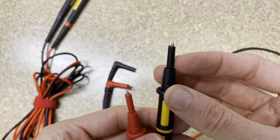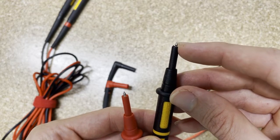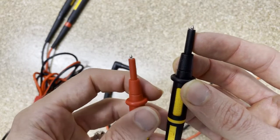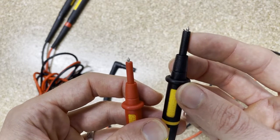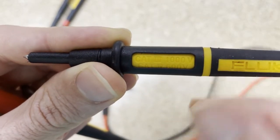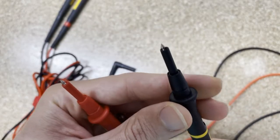You can see they are shrouded. All test leads have to come with only four millimeters of metal exposed if they're going to be used in an industrial environment — whether it's CAT III or CAT IV. You can see we only have four millimeters exposed on both the red and the black. A lot of times they'll come with cones, but most people throw those away. These are rated CAT III 1000 volts, CAT IV 600 volts — the highest rating for test leads right now.